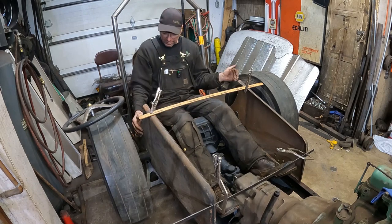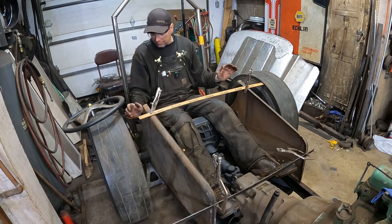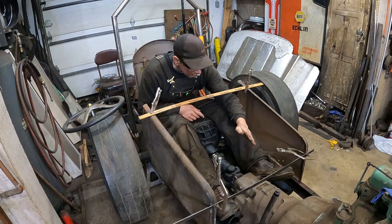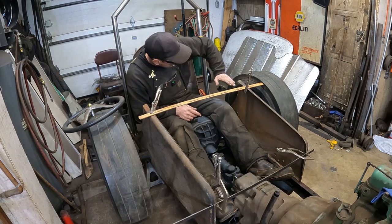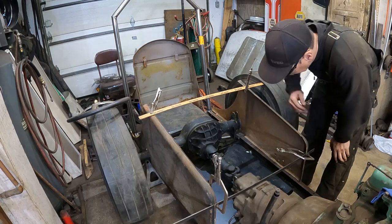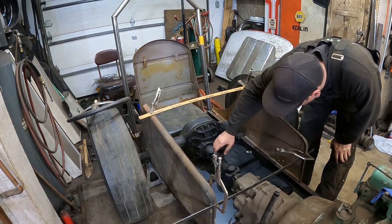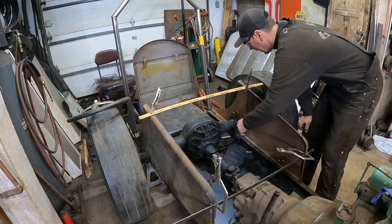It kind of works out with the cuts here, right at the rear end, like a wind foil, and then you're back here with the tires. I'm thinking I can make a down bar that's going to come right through and the body can attach to it, like have an up bar and a cross here and have a bar come right off the roll bar right through there. But how cool is this, huh? Bam. And there's going to be a real tight drive shaft tunnel. I'm just going to form that up and over and bolt it right to the floor, just like 16 gauge sheet metal, and probably run some reinforcements on it just to keep the drive shaft from exploding into me. That'd be bad.